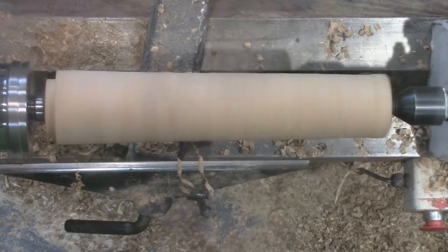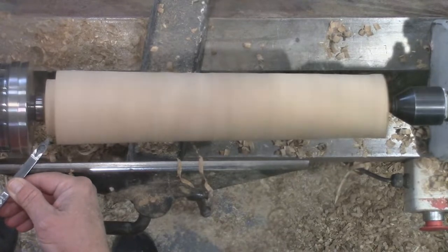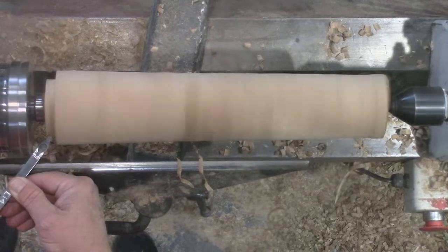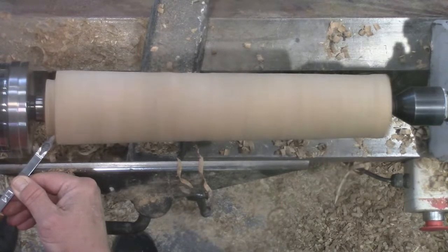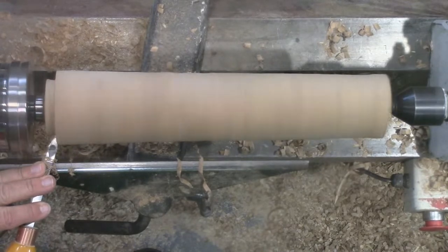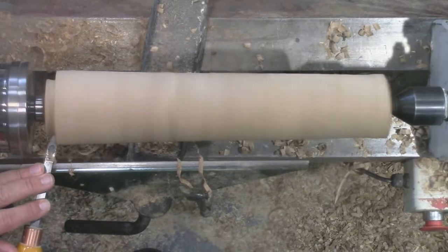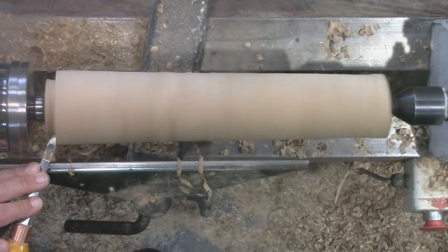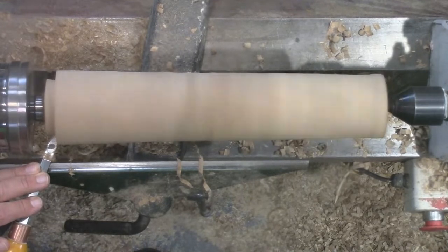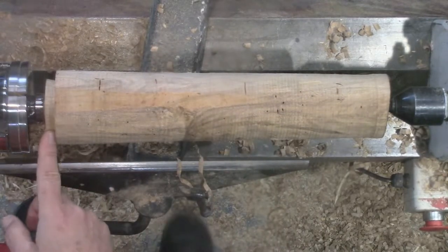Now I also need to put a little dovetail on there as usual. Again, I'll use the Easy Wood tool. I'll use their detail tool. And it's a little tricky because of the space here. So we'll put our dovetail in here. Come at it from two angles. The key being that we have a nice flat shoulder right in here. Okay, so we've got a nice shoulder there.